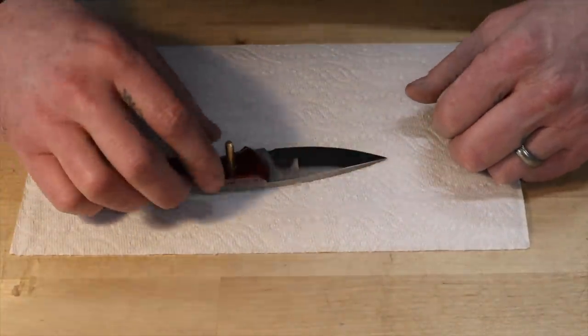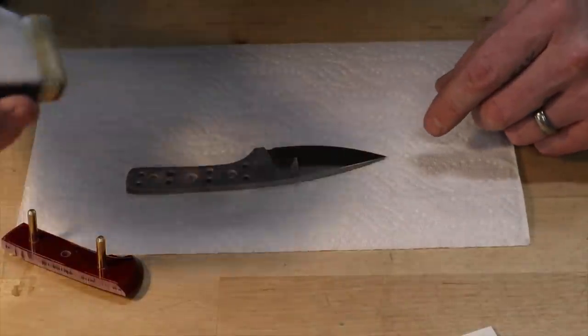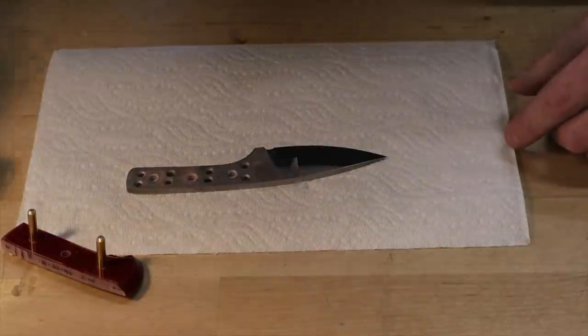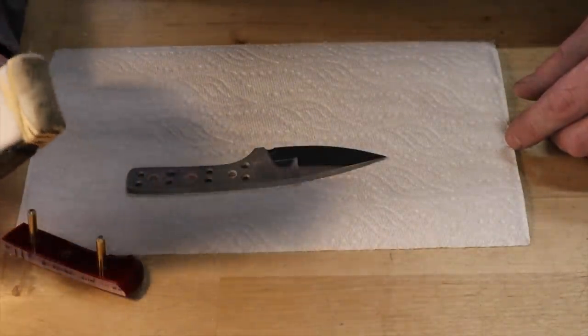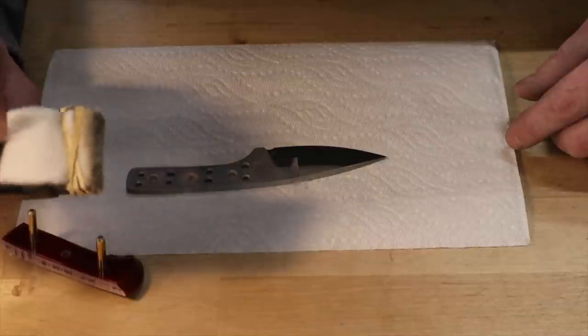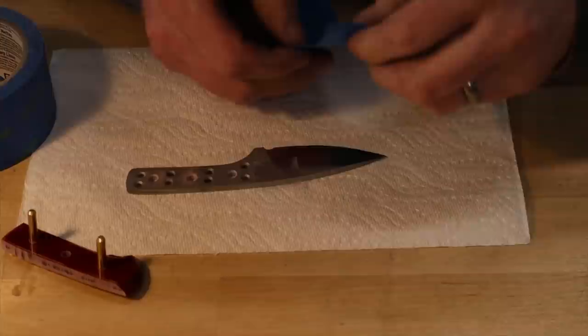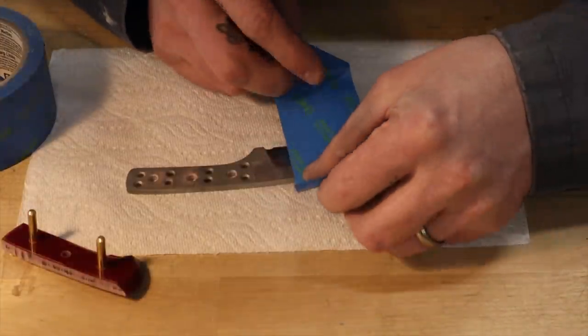I like that — that looks real good. I'm using an electro etcher, specifically the Personalizer Plus — a DC/AC etcher. The negative lead is the carbon brush and the positive is the clamp. I tape off all the extra areas.